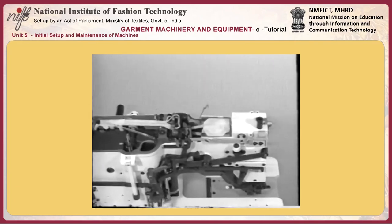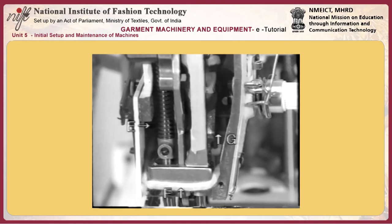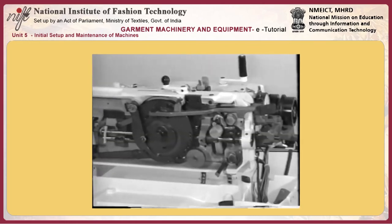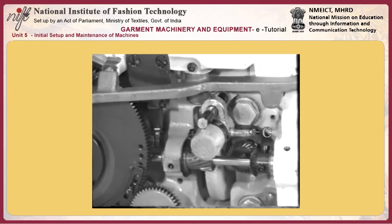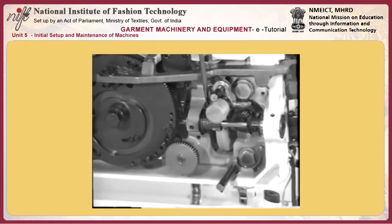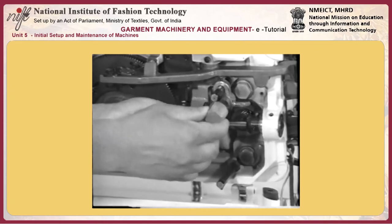5. Removing top cover G. Remove 7 set screws. Remove 2 spare gears H. Loosen set screw I in each spare gear bushing and detach 2 spare gear bushings. Detach knife bar drive lever spring K and presser bar lifting lever spring L. Fitting the screwdriver to points M and N of the recess on the top cover, prise open the top cover until it comes off.